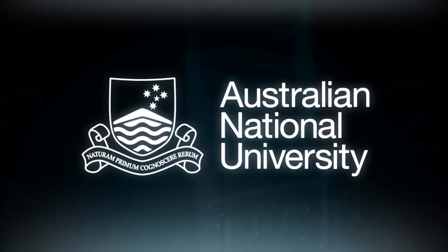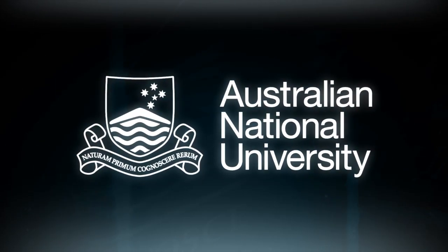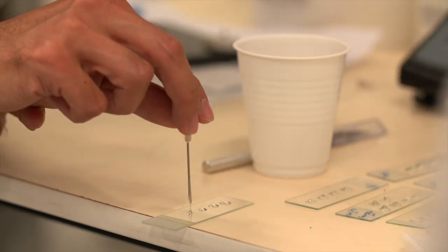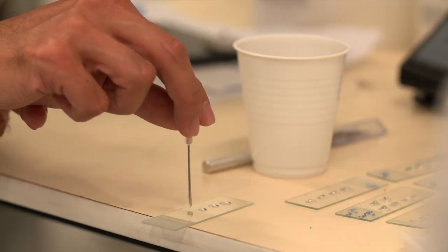What I've invented was a simple process to make high-powered lenses. The process is quite simple: by mixing a solution of silicone gel, we extract a little droplet, put it onto a flat coverslip, and flip it over and allow gravity to pull it into a nice parabolic shape, thereby forming a nice lens.